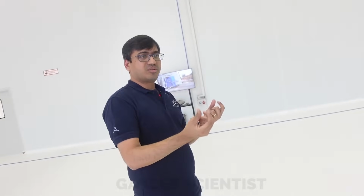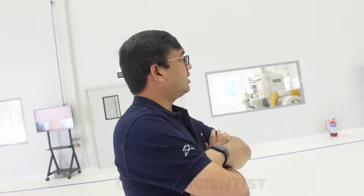Will the launch clamp also have something like that? When you assemble on the launch pad, will it also be able to do this CG calculation? No. For a full stacked vehicle, you just want each element, because we want that launch ground to be super rigid. This is not rigid because it has sensors in between, on very thin sections to measure it. So generally on launch we don't do that, and that much is not required anyway, because we do it section-wise. And wherever propellant is there, propellant takes care of the CG. You put in several tons of propellant, and for example in the solid motor you have a mandrel in between. It's very accurate, then you get the CG right at the center.